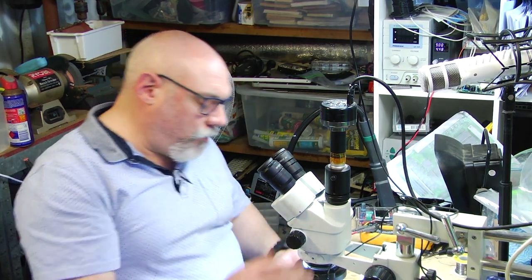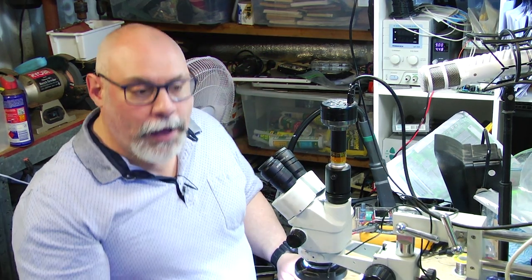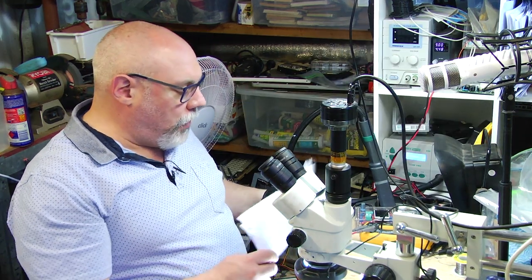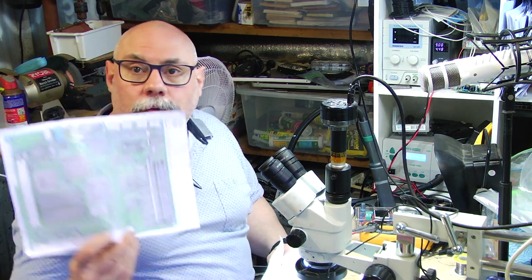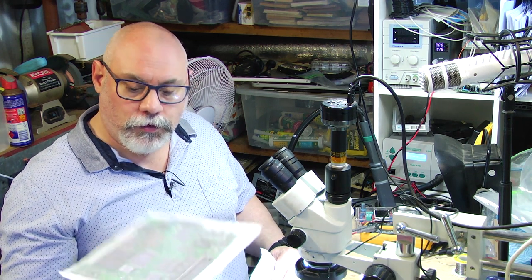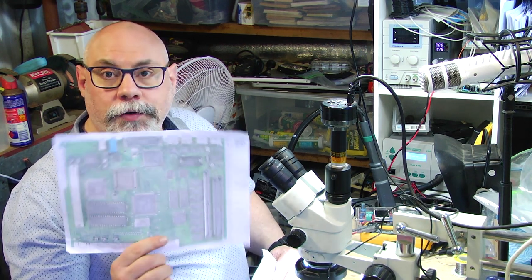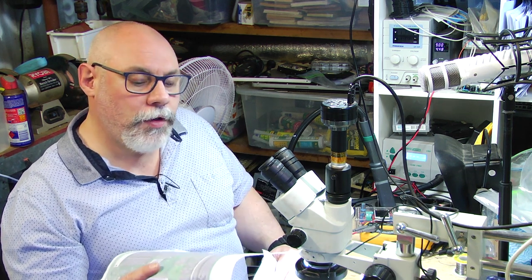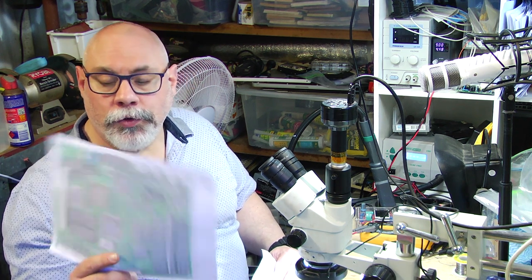Okay, so we have already removed 1, 2, 3, 4, 5, 6 of the capacitors. As I have mentioned before, when it comes to doing any sort of recapping, it's good to have a guide as to where everything goes afterwards. I have my little cheat sheet, which I will put a link to in the description, which is essentially just a picture of a Color Classic logic board with all of the different capacitors, capacitance and voltage ratings marked out and where they go, so that if you whip these all off, you know where all the new ones go.